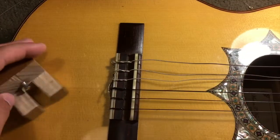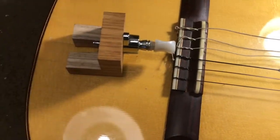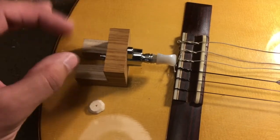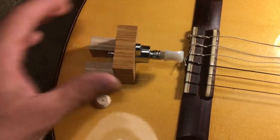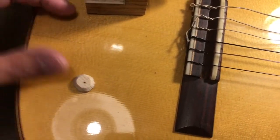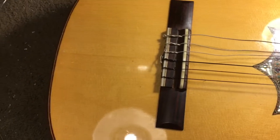And what this will do is basically act as a winch, and we will poke a wire through the crack and tie it to a block, which, as we tighten it up, the wire will pull up on that block, pressing a cleat up against the top. You'll have glue on it. And if this crack is fairly closed, but there was a big difference in height from one side of the crack to the other, the pressure would also pull it together, pull it tight, flush, as we had to do over here.